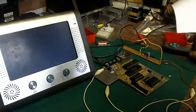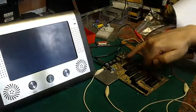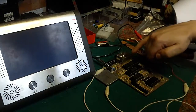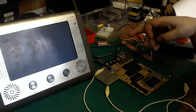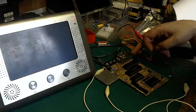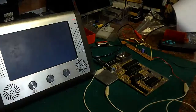But I can do the same basic thing by connecting it to a little transistor amplifier I've got in here. Very, very simple. I did explain how it was made in one of my previous videos. It's just a little 1 transistor and a couple of diodes amplifier for the ZX81. Without this you can't produce a video signal strong enough to run on a monitor.